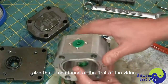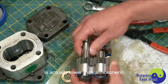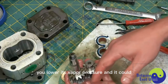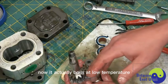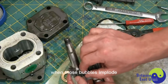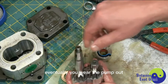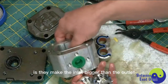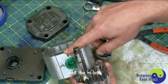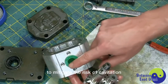Getting back to the port size I mentioned at the first of the video — why would you have two different sized ports? Because on the inlet, the pressure is actually lower than atmospheric. When you suck on a fluid, you lower its vapor pressure and it could boil — that's called cavitation. It actually boils at low temperature. Cavitation creates tiny little bubbles, and then those bubbles implode, taking a chunk of metal with them. You do that billions of times, eventually you wear the pump out. So in order to mitigate that, they make the inlet bigger than the outlet, so when it's sucking from the tank, there's less chance of it cavitating. The inlet is bigger than the outlet to mitigate the risk of cavitation.